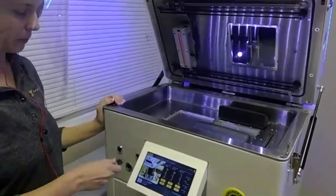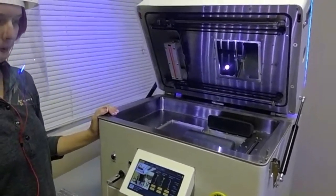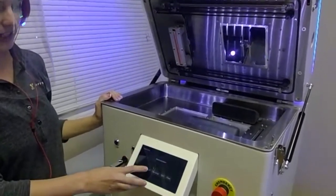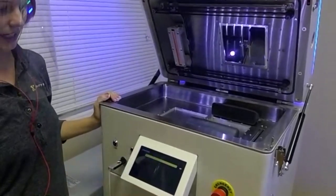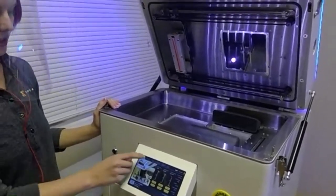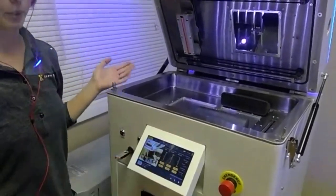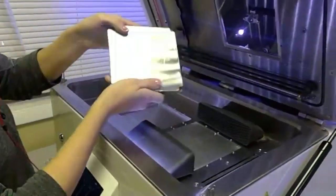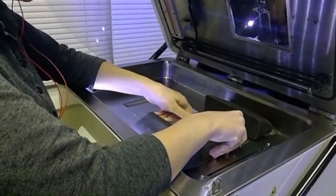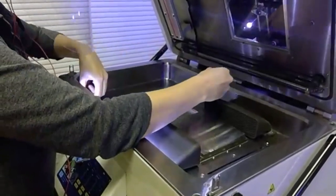Here we have the thumb drive with our print that we exported. To upload it, we simply put the USB inside the printer, and then a notification screen will pop up. Using this, we can upload our build — and here it is, test parts. You can even upload prints while the printer is already running. To simulate starting a print, we can add a build plate. These are made of A2 tool steel and we reuse them between prints. We simply drop it in and use a three millimeter hex key and four screws to bolt it down.